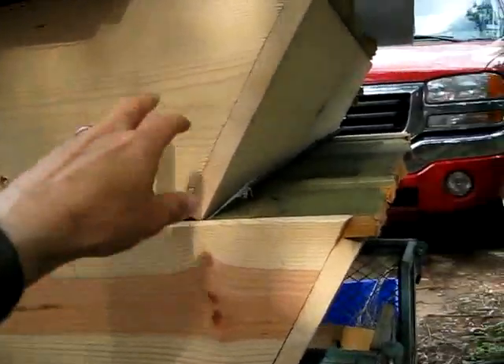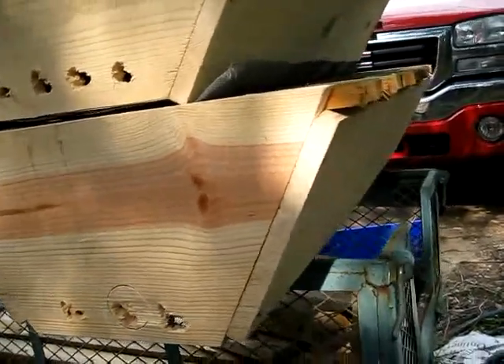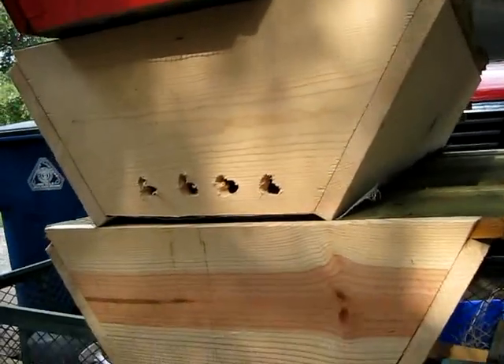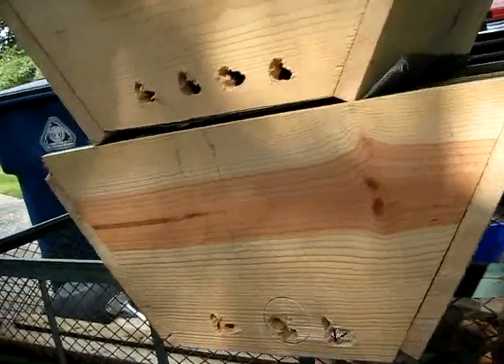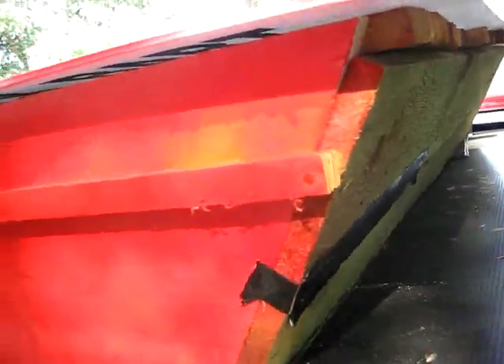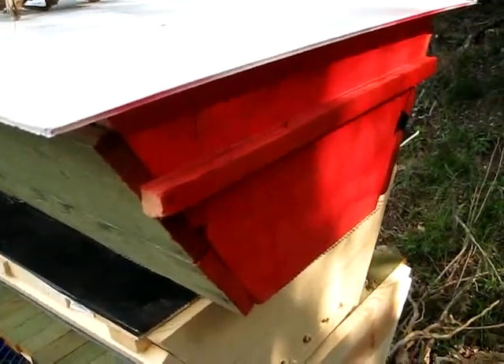These lower hives are untreated wood. What I'm going to do today is take some boiled linseed oil and some wax, heat it up, and paint these things so they can last out the elements. The fence planks have already been painted, so that gives some protection — I just have to make sure the ends are painted. This one I had fun with and just painted it with red paint.